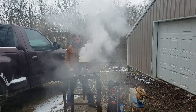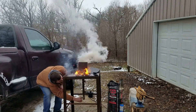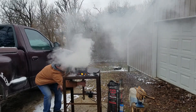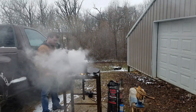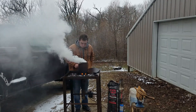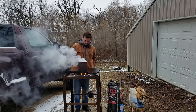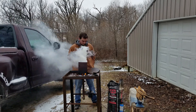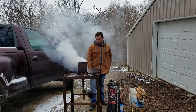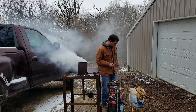You'll see me checking my air pump just to make sure I'm not blowing too much air into the firebox or not enough. It's kind of a balancing act — you need to make sure it's intense but not so intense that it burns away your fuel before it can catch the charcoal on fire. Every once in a while I'll listen to the charcoal, and once I hear it crackling I know it's time to put in a little bit of coal and a little bit of charcoal, then flip over the chimney.